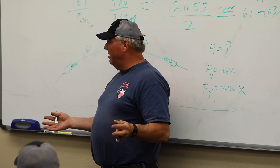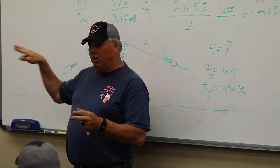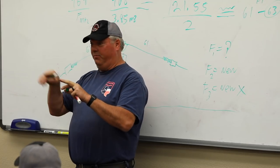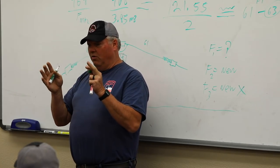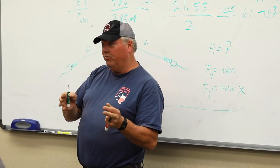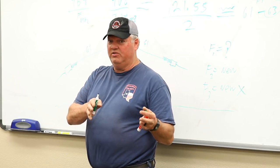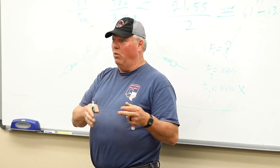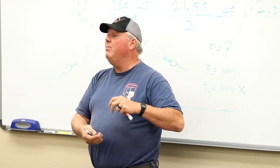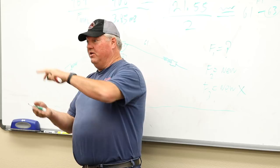We'll bring in another machine that'll hook up to the TV, and you can visually look at the frequency response of a balun. You'll see it up there, and it'll show you what its SWR is and what its frequency range is. Will it work on 80 meters? Will it work on 20 meters? Will it work on 160? Or is it so inefficient it can't work? And why would you want a different balun for 160, 80, and 20, and then maybe a different balun, depending on who makes it, for 80, 40, and 20.